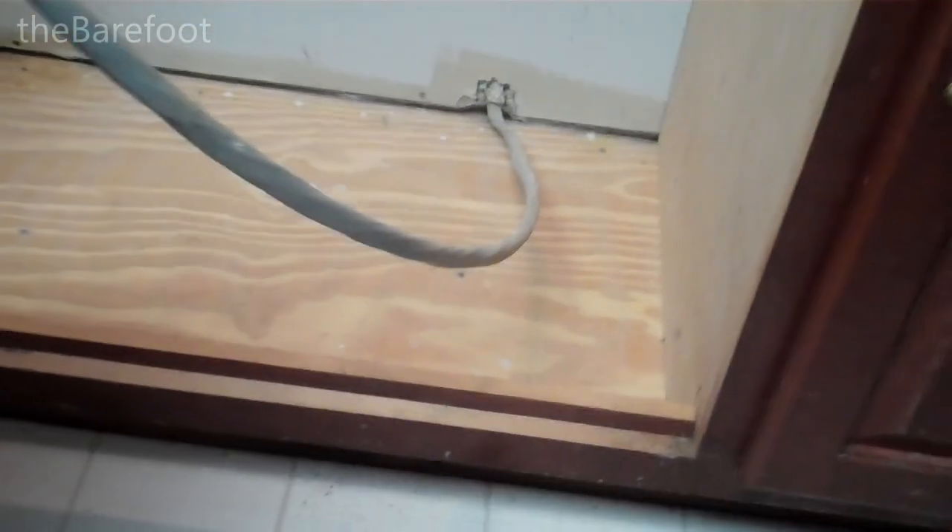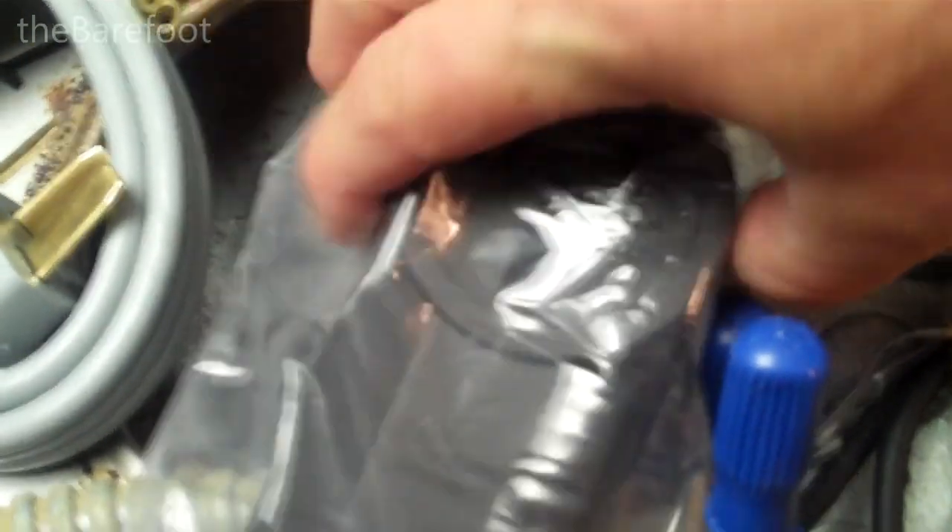You can see this kick panel — it fills in the bottom of a drop-in. So I've got to cut that wood out, and I have to fix what the mad electrician did to wire this house. As you can see, this cord coming out of the wall is the wire for the range. And yes, I've turned off the circuit breaker. It comes to a junction box, not a plug. My project today is to get rid of this junction box and replace it with a three-pronged outlet so I can plug up the new range when it gets here on Wednesday.